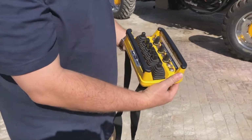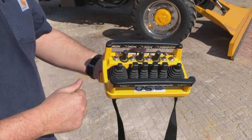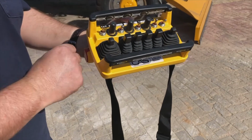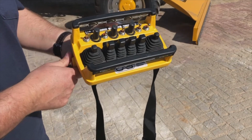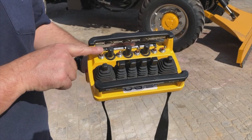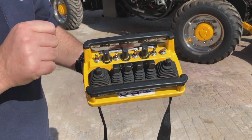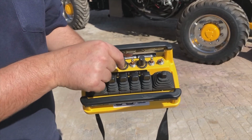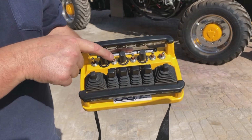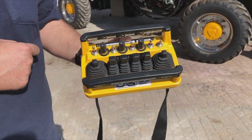The first thing is we need to ensure that everything on this is in the off position, okay? Emergency stop is in. We already checked that before we started, but nothing will happen if we started it with it out anyway. Any control that is centralized with a spring-centered toggle, like the start button, just needs to be in the middle. All of our potentiometer dials need to be in the counterclockwise off position. Our toggle switch for activating the conveyors needs to be in the off position, okay?